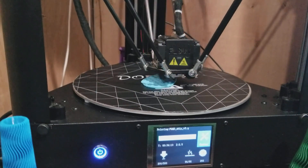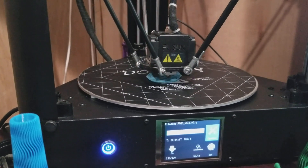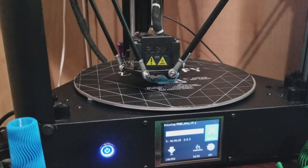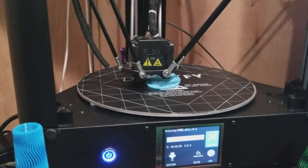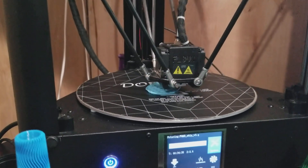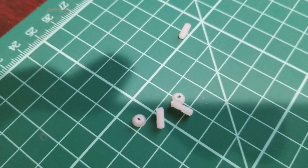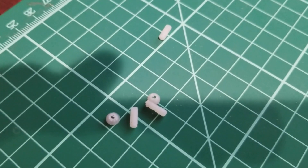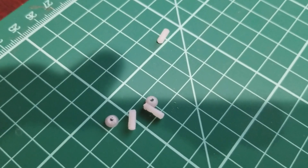But when I first got the printer, it was too low to the mat, so it was welding my prints into the print bed. I managed to barely get the first one or two prints off. I tried a third print without properly adjusting the Z offset, and that print welded in so hard that when I tried getting it off, I found out the hard way that the bed is attached with nylon screws — not metal. There are three nylon screws that attach the metal heated plate to the chassis. As I was banging on the print that was welded to the mat, I sheared all the screws off.